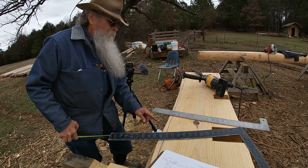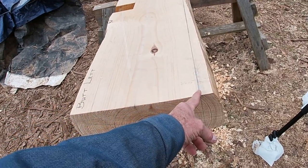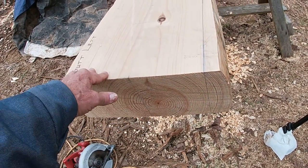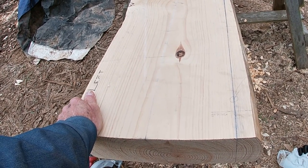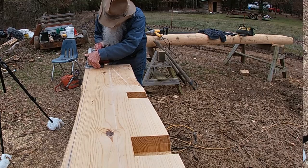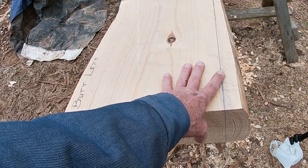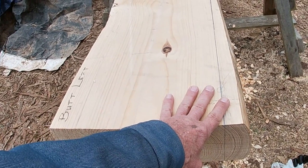Now I'm going to rip the bottom flat. Normally I'd make a cut with my chainsaw as long as the bar, down along the side of this line and about halfway through on each end, then walk down the log with the chainsaw — but I'm not going to show that because I don't want to demonstrate anything you might not feel comfortable with. Instead, I'll just use a circular saw and cut down along that line. This saw will only cut two and a half inches, leaving about an inch in the middle I'll have to contend with using an axe to true the bottom flat to sit on the piers.